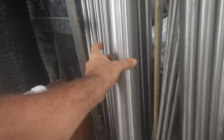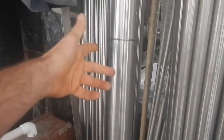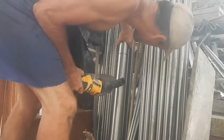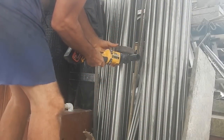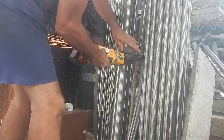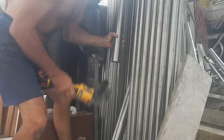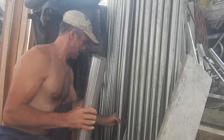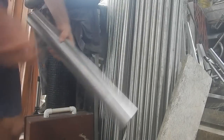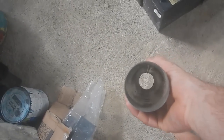This is a three-inch tube — it's 304 steel. I bought it a while ago when I bought a whole bunch of tubes. I'm going to cut it right here and figure out how to make it work. First step is to cut off a piece. I've got my sexiest clothing on today because I just don't care. I've got 1.5 millimeter wall thickness here, which should be pretty good. I'd kind of like a four-inch tube for this, but this is what I have and it should be fine.